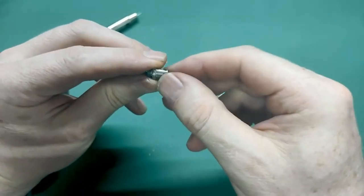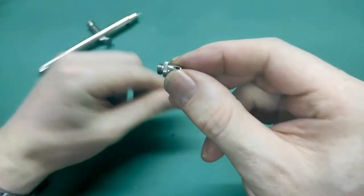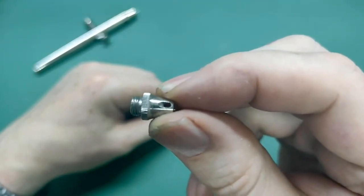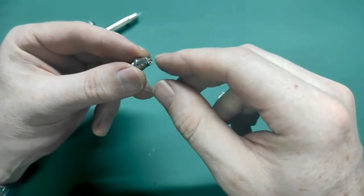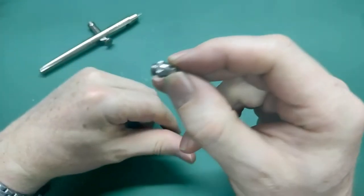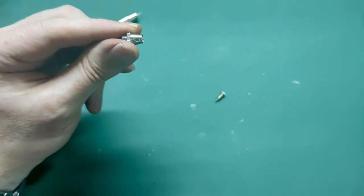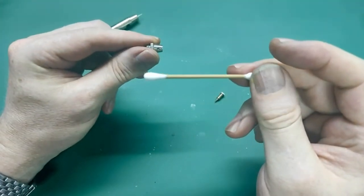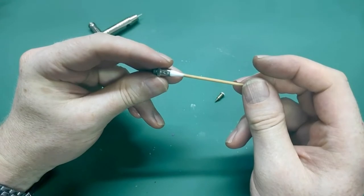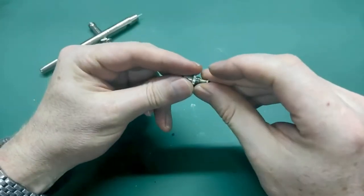You also get one with a fork design, where it's just a pin at the bottom and a little metal pin at the top, and then you can clean it very nicely if you have to. But this one, no. Also, blowing back with this, if you just put your finger in here, it's not going to work because all the air will go out there and you will not blow back your thinners. So you just have to take a Q-tip. I don't know what a Q-tip is. Here we go. One of those. Just put it in here once your needle is out, of course, and blow it back. Or pull your needle back and put it in here. Works fine for me. It's not a train smash, but it's not as good as others.